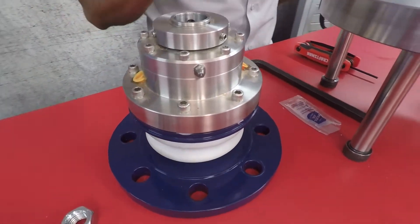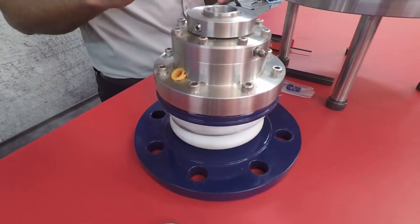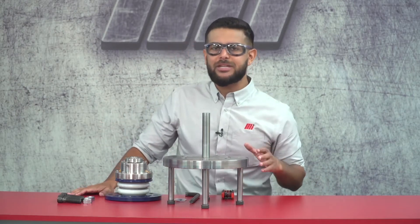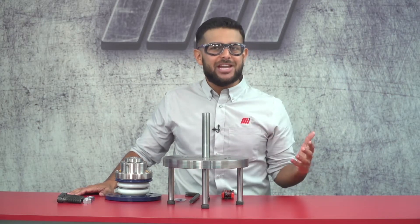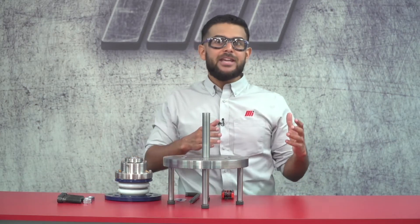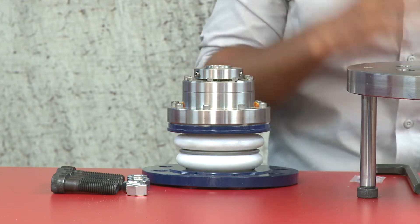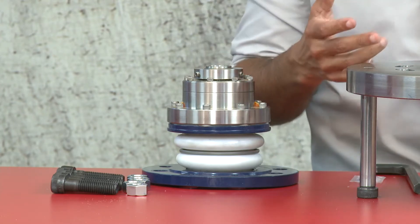Here's a little background on the Garlock 3D Seal and its cartridge design. The Garlock 3D Seal was designed for operation in equipment that is plagued with high misalignment and runout. If you have a dynamic sealing challenge with excessive runout or misalignment, then the Garlock 3D Seal could be the solution that you need. The Garlock 3D Seal tends to be used in agitators and mixers in food and beverage or chemical processing, but the reality is this seal was built on its capabilities and is relevant for many industries where misalignment and runout may occur.